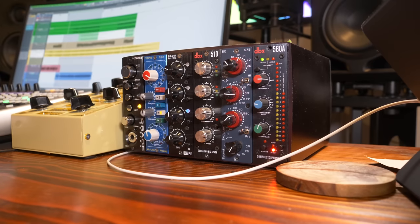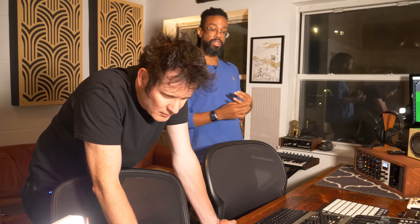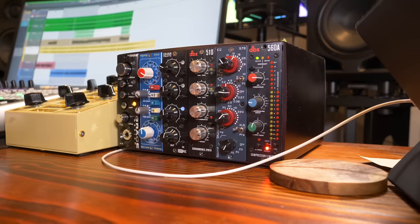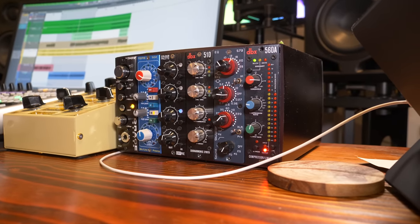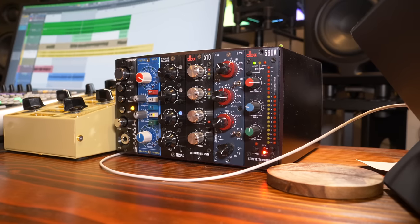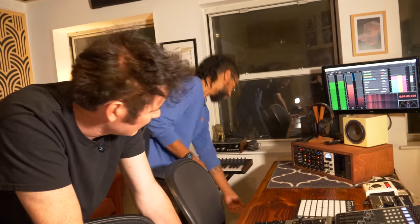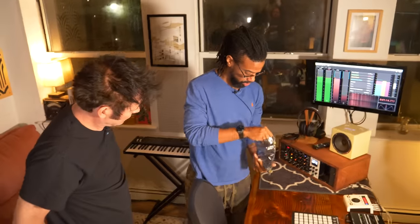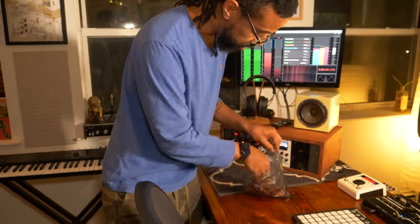Those are saturation units from DIY Recording Equipment out of Philly. They sell you a kit and you build it — get your soldering iron out, it's like Lego for audio. You put it all together and get really nice sounding gear. Each of the top three knobs has a different saturation circuit in each one, and I can swap them out — I've got a bag full of different chips and circuits. This one is Avinton Audio — it's like a smash compressor. If I want to get grimy I pull the thing out, pop this in, and dial in however much smash I want. I've got tube screamer circuits in there too — whatever saturation I need, I've got it.